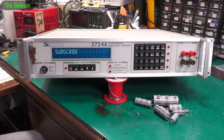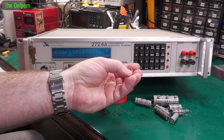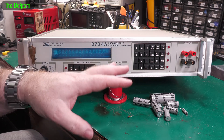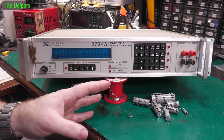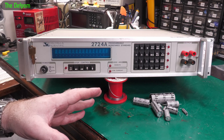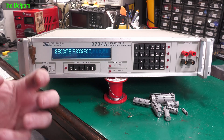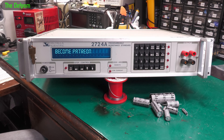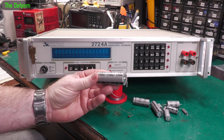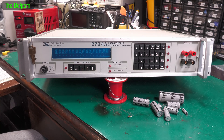Happy with that, very happy considering the price. Basically the money I saved from this compared to buying one which was working is significant - I think I saved a thousand dollars by buying a broken one. So this one little tantalum cap here saved me a thousand dollars. These caps here, it's an investment - although it was working okay as we saw, and it seemed to test okay in circuit, the LC-102 wasn't so happy with some of these caps. This goes to show that even though you do in-circuit testing, you can't really 100% rely on it until you take them out and measure them properly with a proper capacitor tester. Doing ESR measurements and capacitance measurements in circuit only tells you part of the story - leakage is part of that too. Although the ESR was very low on this one, like 0.06 or something, the LC-102 said it's a bad cap.